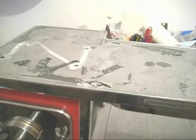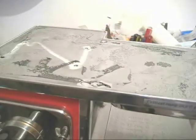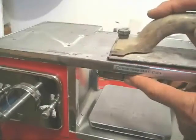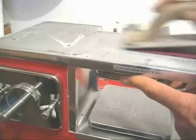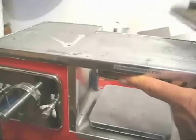The next step is to clean this surface, and we're going to glue the new sheet metal on. When we're done, it'll look something like that. After I've cleaned off most of the glue, I'm going to sand it with 100 grit sandpaper, just to rough it up a little bit so that the contact cement I'm going to use will adhere better.